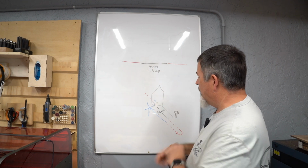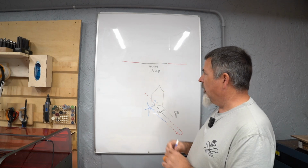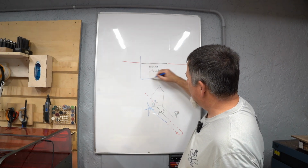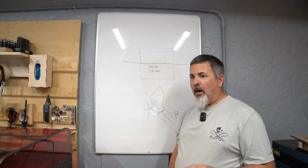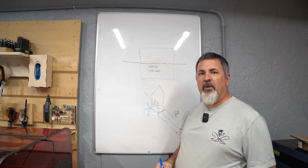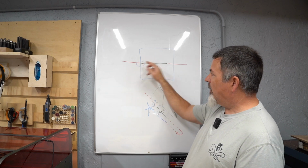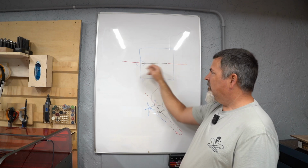There is a problem with this, and a lot of you have seen this. So if your machine claims it can do all this speed, and maybe you're new to the engraving world, and the first thing you do is you drop your material in there, you put your design right up against the edge, and let's say your machine looks like this. You plug in those numbers and all of a sudden you get a warning that says, hey, I can't do this. You risk crashing the head of your machine or object out of bounds, something to that effect. And more often than not, it's going to be because of this. So just like your house, crash into the house going back, I'm going to crash into the side of the machine if I try to decelerate and I don't have enough room to accelerate to get up to speed.